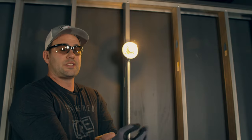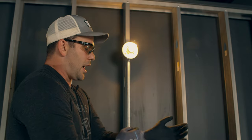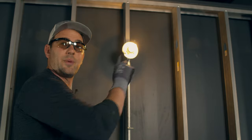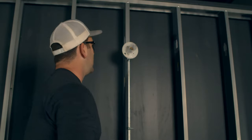Another thing you want to consider is work gloves. Just like safety glasses, you will never regret wearing safety gloves. So if there's a cut potential or anytime you can really mess up your hands, you want to wear gloves. I'm putting gloves on now. Now I know what some of you are thinking — that light bulb is on, am I going to just grab it? Absolutely not. What's the only safe way to work on electricity? De-energize it. I could go unplug this temporary wall, I could go turn off the breaker — which you should do — or I can just turn off this light switch. The circuit is now de-energized.